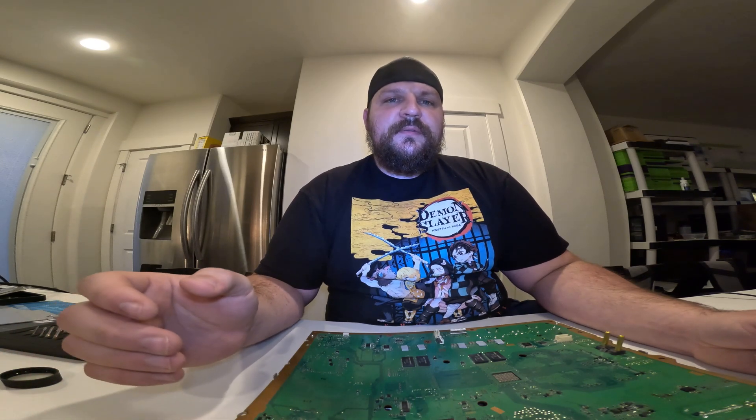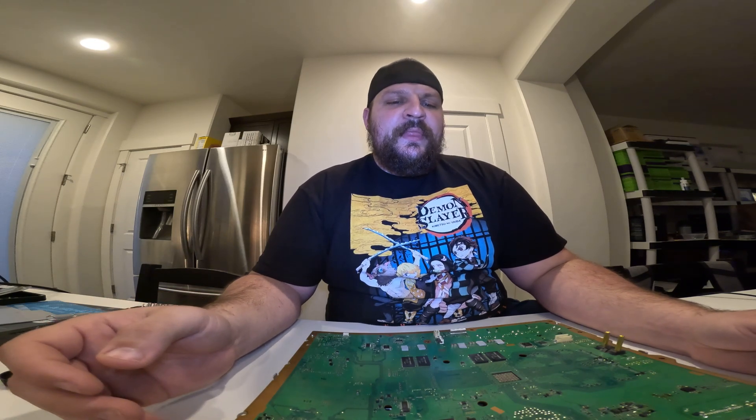A viewer reached out and provided me with their broken PS3 to see if I can repair it. By the way, this is the console. I took on this challenge and looked up all the different unique reasons why the Yellow Light of Death would happen. I saw a lot of feedback about capacitors, BGA issues, needing a reflow or a reball, but that wasn't sufficient for me. So I did a lot of research and found that the PS3 will store 20 error logs inside the SysCon. If you can read the SysCon, it'll tell you the exact error, helping you pinpoint exactly what went wrong.